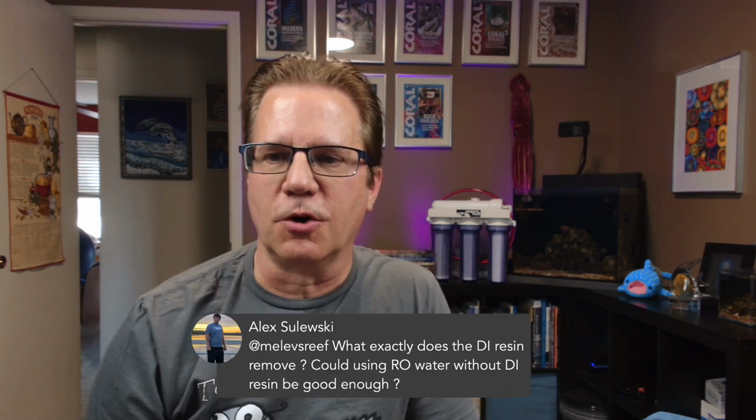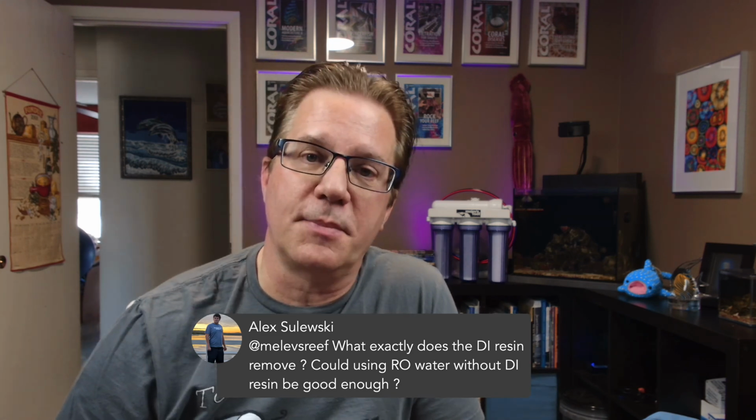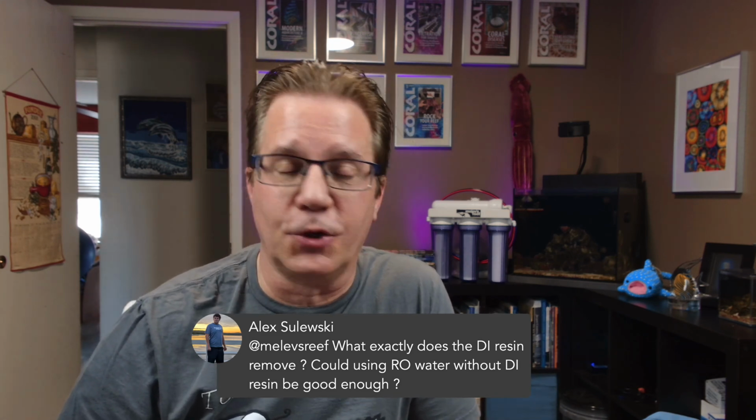Alex says, what exactly does DI resin remove? Could using RO water without DI resin be good enough? Depends where you live. Depends what's coming out of the RO. If it's coming out close to 0, you probably could. You could probably be fine. I'm going to move this closer, sorry. The DI resin polishes the last of the TDS away. The membrane did all the work.